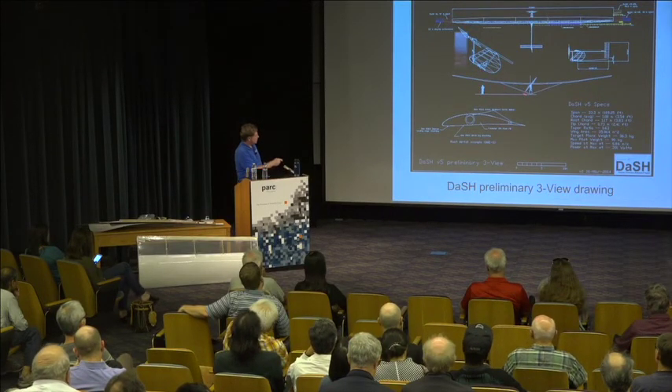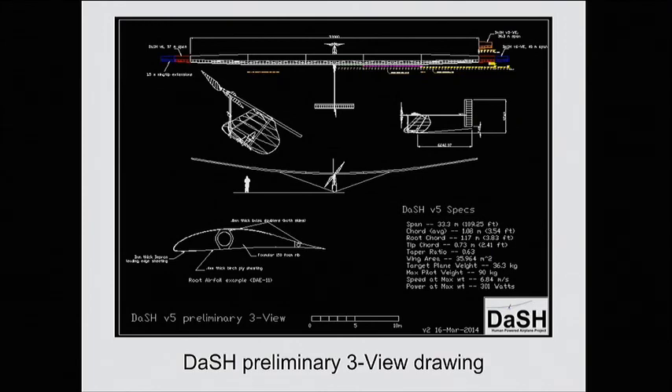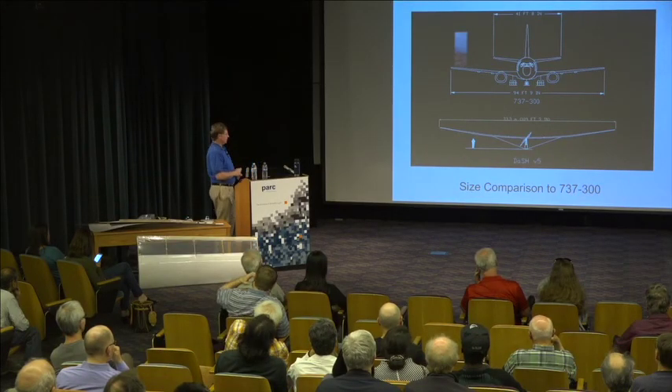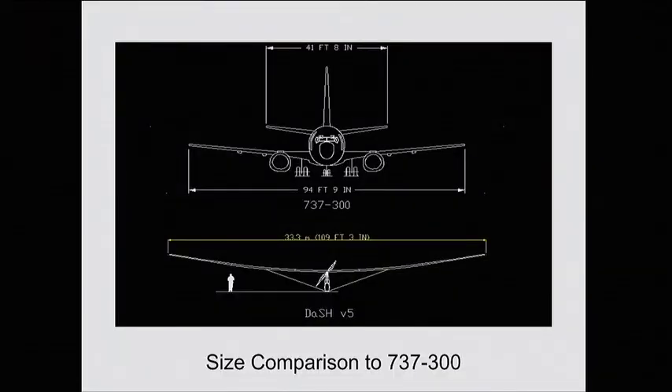About the lift wire: it adds about 8 watts of drag just from the wire itself, but you save about 8 kilograms of weight in the middle, and it's about 3 to 3.5 watts per kilogram that it takes to fly extra weight. So about 30 watts is saved by having about 8 watts of drag from that lift wire. To give you an idea of how big the airplane is — this is our shortest wingspan version of DASH next to a 737 that you're all probably familiar with. This weighs about 45 kilograms, or about 100 pounds, and that weighs about 70,000 pounds.